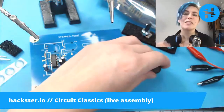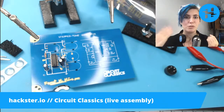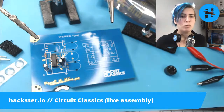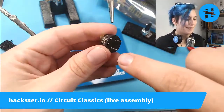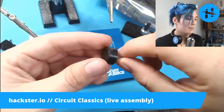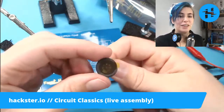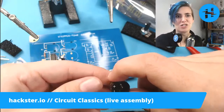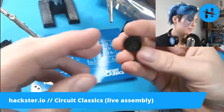Cool. But the deal with any speaker is that it is a vibrating membrane that vibrates the air and sends basically waves of differential pressure that hit your eardrum and make that vibrate. So that's why it doesn't matter so much if a speaker is wired up the right way or the wrong way, if it's a really simple one like this, and if it's mono, not stereo. Since it's just a vibrating membrane, it doesn't really matter which way it's hooked up because it's going to vibrate at the same frequency, and you're not going to be able to tell if it starts with the membrane being pulled in toward the magnet or pushed out away from the magnet. So it's pretty much the same.